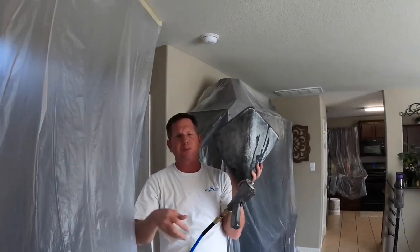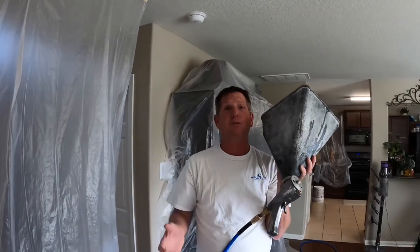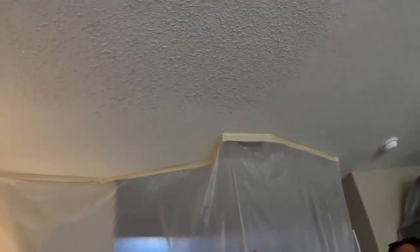As you can see, I've got everything spaced out real nice. You don't want to get too much - if you get too much when you wipe it, you're going to get too many flat spots. This mud is probably a little bit looser than skimming mud, but not as loose as you would for a light orange peel. You want the mud to be a little bit thicker - really as thick as you can get it through whatever hopper you're using. We have to let this set up five to ten minutes depending on the thickness of your mud. We'll cut video and come back when we can knock it down.